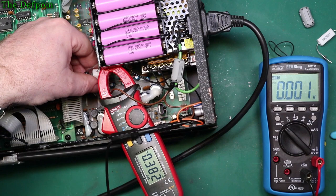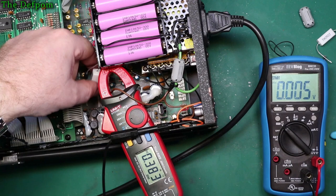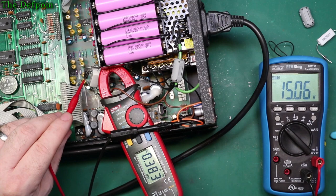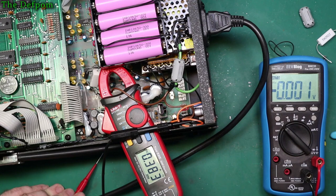There's a little bit of heat, but it's not too bad. It's not like it's getting hot really quickly. It's been on for a few minutes now. These are designed to get hot, and it's fine. It's getting warm, but what's 2 volts across 0.4 amps? That times 2 volts. So if I call that 400, that's about 800, so 0.8 watts is what's basically being dissipated across this resistor. It's a 5 watt resistor, it's fine.